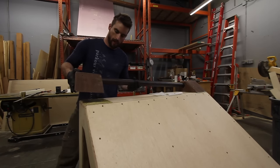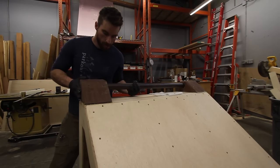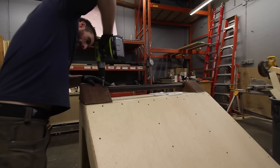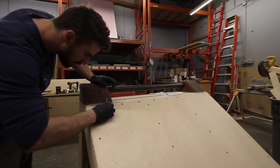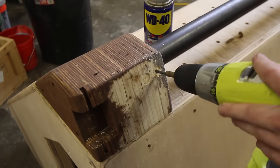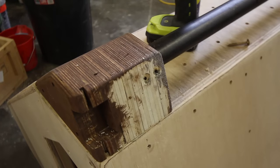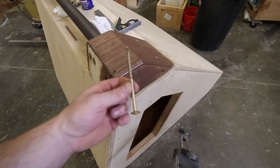I've used this method before for bars for precision trainers and it works rather well. You use polyurethane inside of the hole and then go back in drilling through the wood and the bar. You can see me putting in a slightly larger lag screw, which prevents the bar from spinning, and then the glue does the rest.